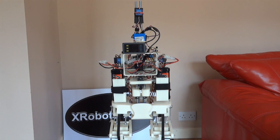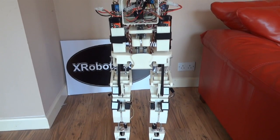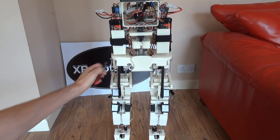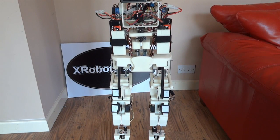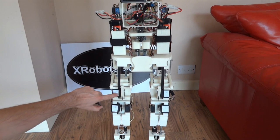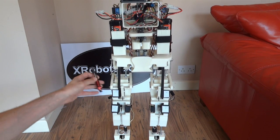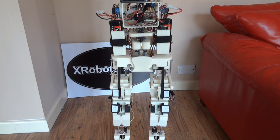The plan was to try and get some short steps in between to make it walk along, which I've just about achieved, although it doesn't work as well as I'd like. I've made a few tweaks, including taking out the dampeners I had on the hip actuator and replacing them with solid links. The main problem is that the hip servos aren't really strong enough to move the thighs backwards and forwards.